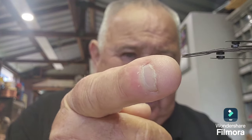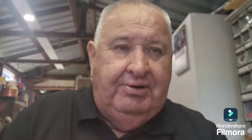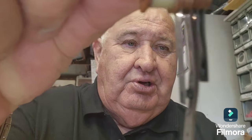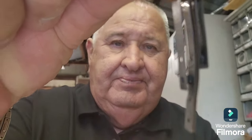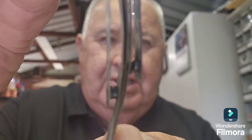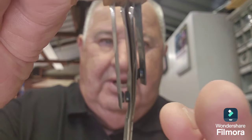If you look closely, the bottom switch is normally open and the top one is normally closed. That top switch is the motor run switch, but it was really badly bent — someone's done a real job on it. We've straightened it up a lot, but decided to replace it. If you watch carefully, as I break that top switch, the bottom one closes — they're touching together. That's why the motor wouldn't stop, so we replaced that stack with one from our spare parts.